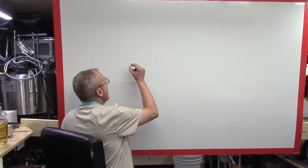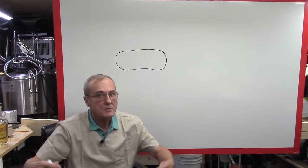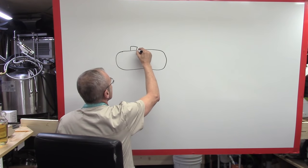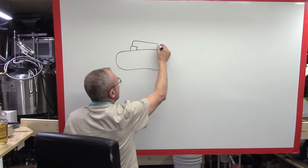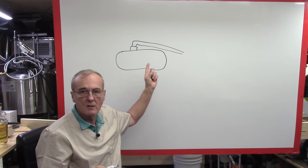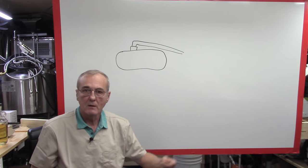So when we have a still, and let's say in most cases, or in a lot of cases, we're looking at 350, 600 gallons. We're looking at a pretty large volume, all right? And this would be a still with some sort of a connection cap to the top and what we would call a line arm. And a line arm is merely a connection point between the still itself and any other apparatus, whether that be a Thumper, which we're getting ready to go to, or if that's directly to a worm. All right, that's with the line arm.